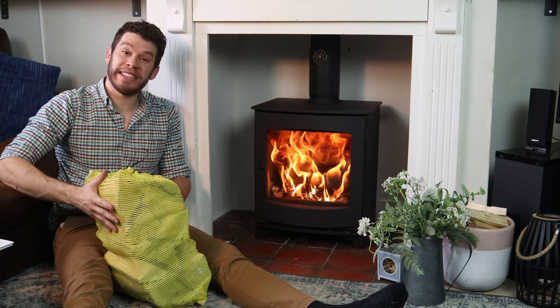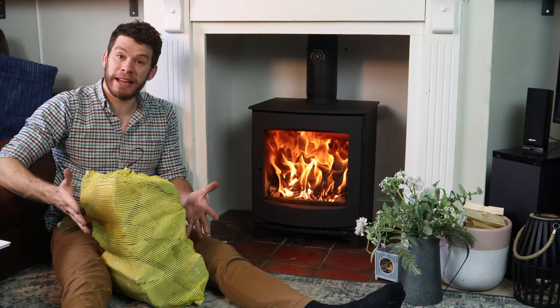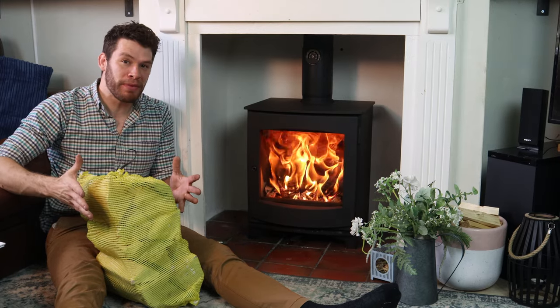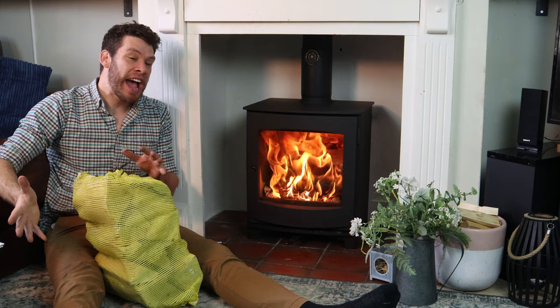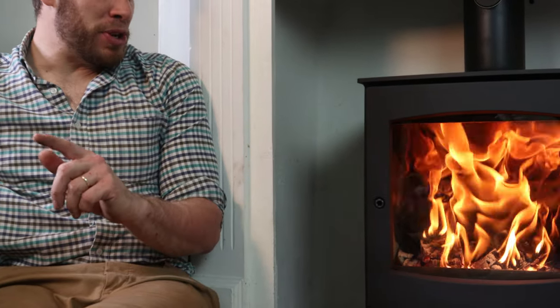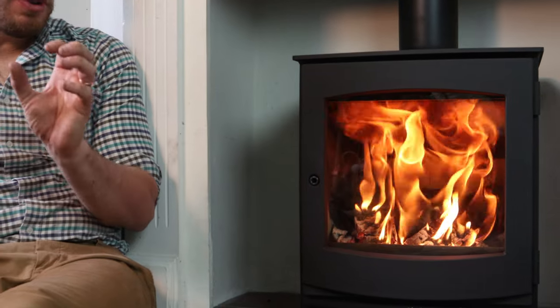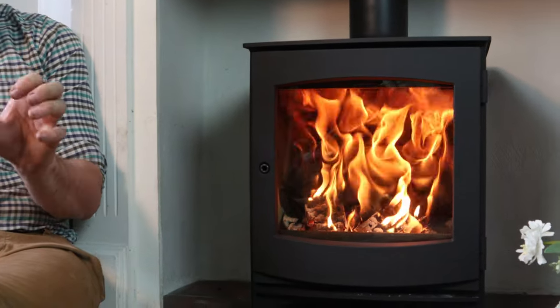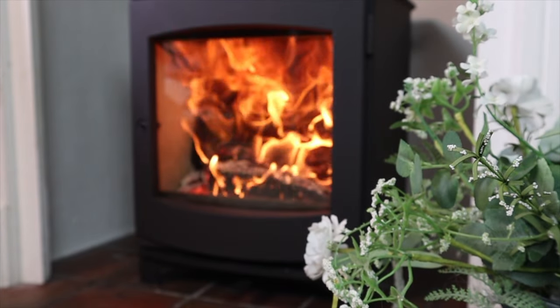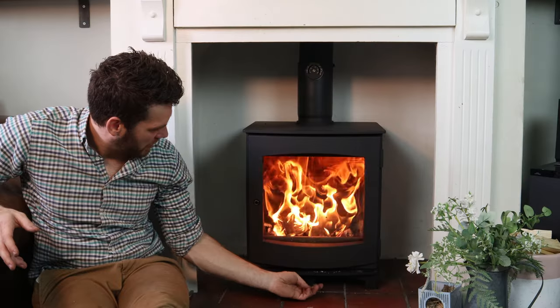We test fuel economy by getting the stove up to operating temperature and then burning a single net to see how long it will maintain it. We did it a few times with this stove and it achieved between 10 and 14 hours. And given that it's got a maximum output of seven kilowatts, it's very economical. When you shut it down, it will run for 12 hours on a single load. The name is questionable and the ash removal is a little interesting. Getting the bricks out is not totally simple. But if you can get past those things, it makes up for it. It has a few quirks, but in terms of its performance as a stove, it's exceptional — I'm genuinely looking at it thinking, what do I pick on in terms of the way it burns and how it controls?